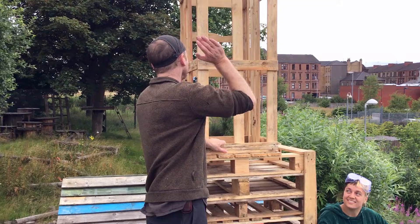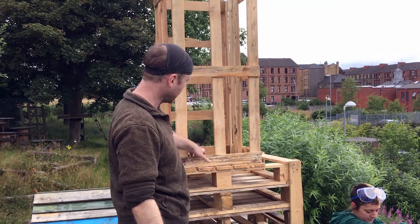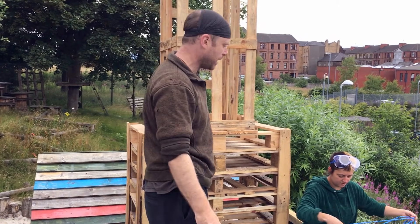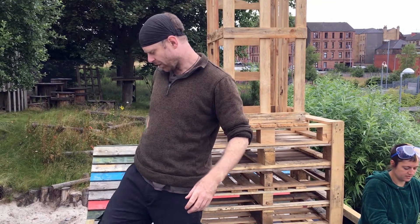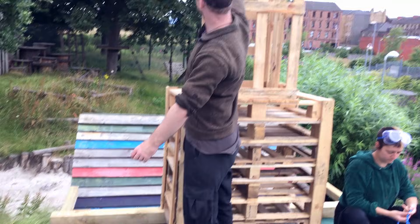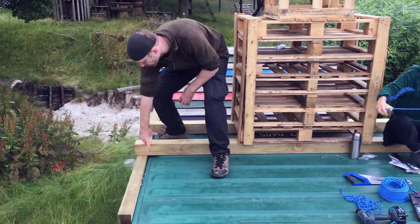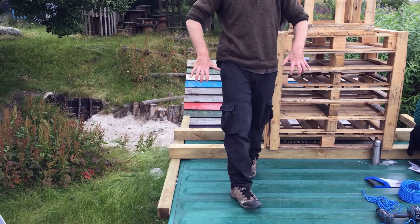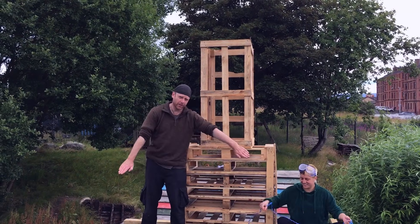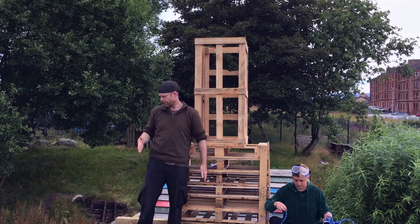So we have got the box for the barrel in place — that's screwed down. Since it's a tall thing in Scotland it's definitely going to blow over, so we have these bits of wood here, and we're going to attach ropes from each of these four corners up to here. These members are bolted down through the lip of the container so it's stable at the base. The panel is now going to be firmly attached here at about a 60 degree angle, aimed for the low winter sun more than the high summer sun — but it'll get both.